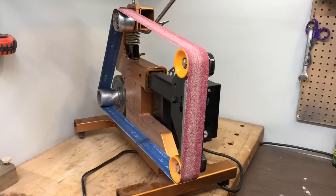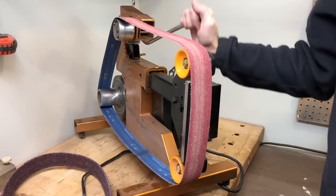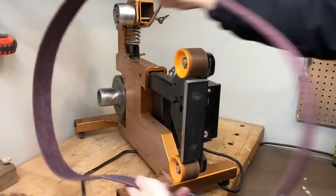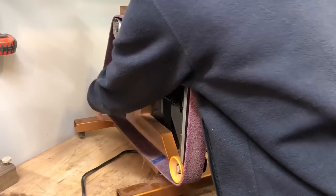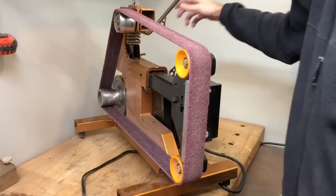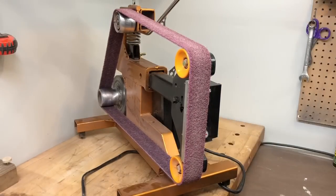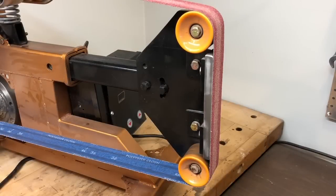Changing out a belt is very simple. Turn it off, hold the handle down, slide the belt off, take the new belt and put it around the motor and the front pulleys, hold the handle down, make sure everything's somewhat aligned, spin it by hand a few times to make sure it's going to track well and won't flop when you start, and you're ready to roll.